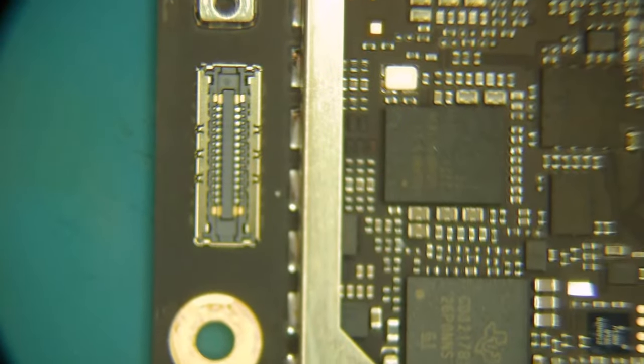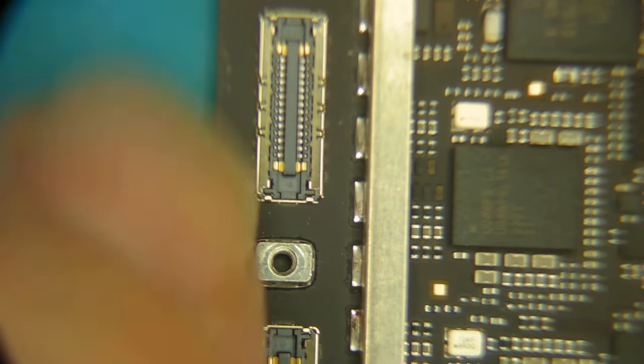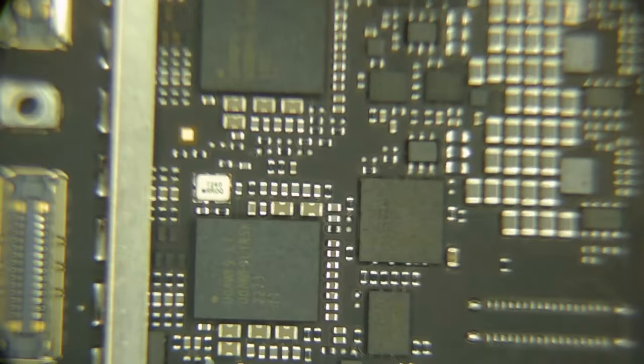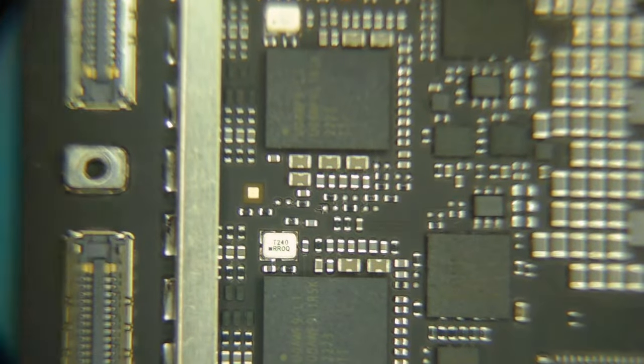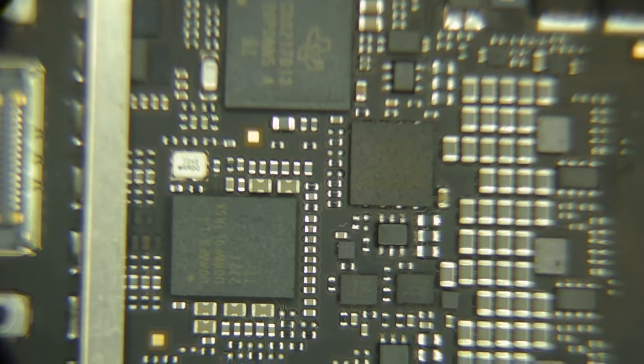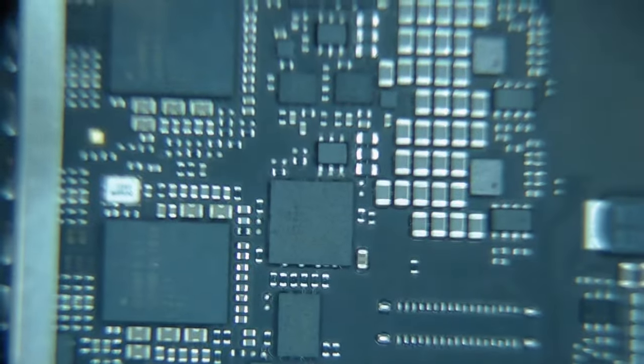So we'll start out here at the edge. This is the inputs, so that looks normal, the normal NovaStack connectors for the USB-C inputs, and CD3217s, okay, that's normal, I understand them, I understand the architecture of that. So anything with input or output or USB communication should be easily troubleshot, because these are CD3217s, they're understandable. Not sure what these Winbond chips are now, though. If these are the new ROM chips for the CD3217s, we have Winbond chips here. We never had Winbond chips anywhere near the CDs before.